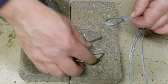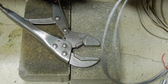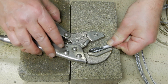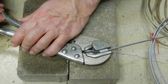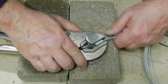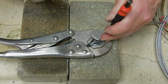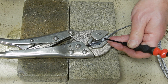I'm going to block the wire rope on one side. Then I'm going to reopen the vise grip and tighten the cable on the other side, because I want to make sure it's properly fastened on that side. I pull on the cable here very hard, and now I'm going to punch it. On the other side I'm going to put three punches, and on this side too — I'm going to alternate.